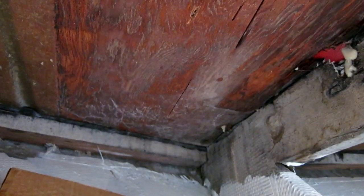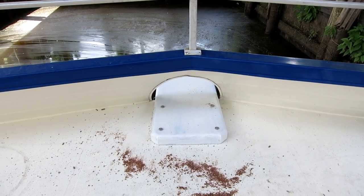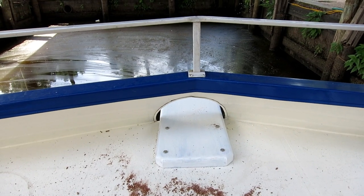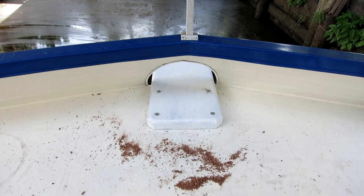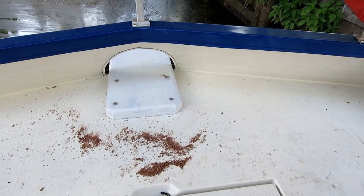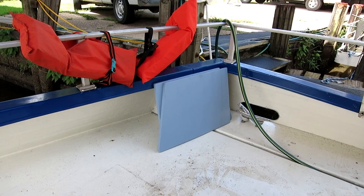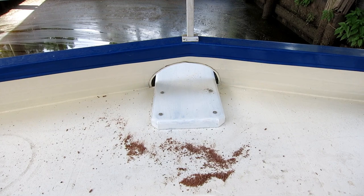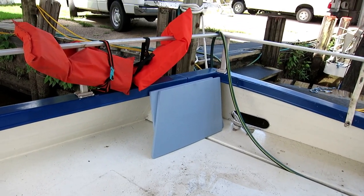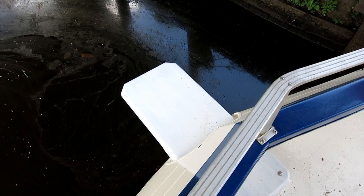If I can make it big enough it'll be stouter than it is now. The anchor pulpit is in place with four five-sixteenths carriage bolts holding it down, just finger tight for now. The holes are drilled, so I'll remove it, sand the bottom of the deck a little bit because it's got some stalactites hanging down. When that's sanded I'll screw these two braces up to the ceiling with caulk or glue, then drill the holes through and reset the anchor pulpit — it'll be bolted through the original deck and through the new stiffer boards.